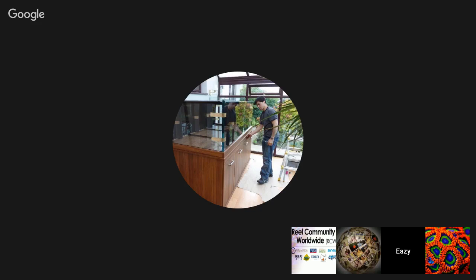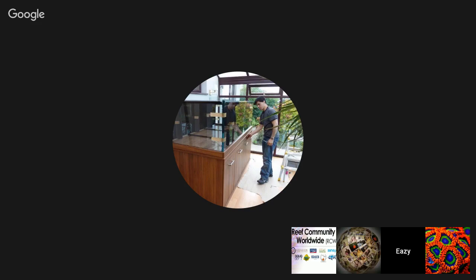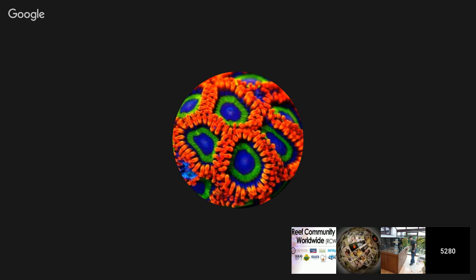Also, the idea with putting the bubbles through the pump is that when the bubbles spin round, they rub and it creates friction, and the bubbles become charged, like negatively charged. So that helps the particles be attracted to stick to them as well. You wouldn't get that if you just stuck it straight in.